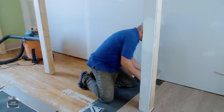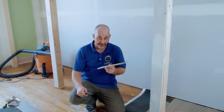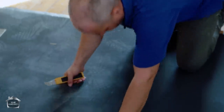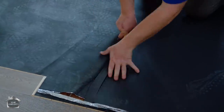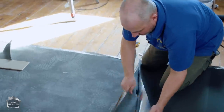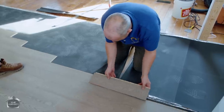This hardwood flooring also works with that laminate flooring guillotine tool — feel free to use that if you have one. Here's a quick trick when finishing a roll of underlayment and starting another: nothing's ever cut perfectly square at the factory, so overlap them a couple of inches and cut them at the same time together so your product seams together really nicely.